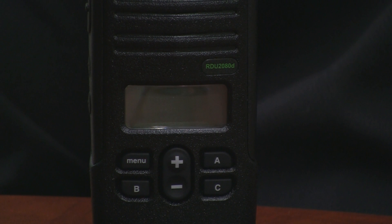Now let me explain what you need to do to make your old radios completely compatible with the new narrowband ready version. You're probably wondering what differences you're going to hear if you don't make any changes at all. The radios are going to communicate just fine, but the problem is if you don't adjust your old radios and you're using a wideband channel on them to talk to a narrowband channel on the new radio, you're not going to get optimal sound quality. One of the radios may sound a little bit as if it's in a tunnel. You want to make this setting change to ensure that you're getting the best audio quality possible.